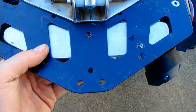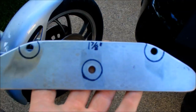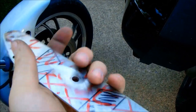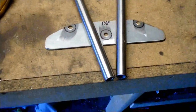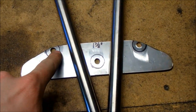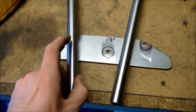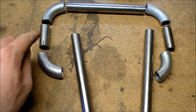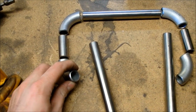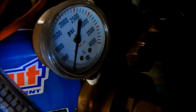Off of that I'm going to weld some pipe to hold on my big bag, so I'm going to go ahead and fasten this down. Now I've got the bottom marked and I'm going to go ahead and make my rails for it. Here are all my pieces for the luggage support: I've got my plate with the washer and nut positions marked so I don't weld on top of them, some half-inch stainless steel pipe, my elbows from McMaster-Carr, and some spacer pipe. It will go across the luggage, come down at a bit of an angle to the elbows, and those will weld to the plate. All I've got to do is weld that up — but one problem: we're out of argon.